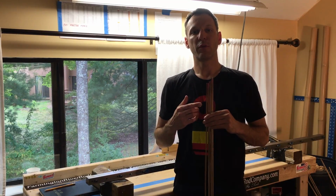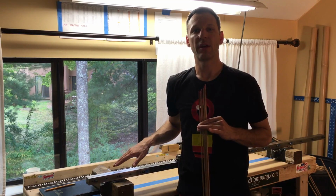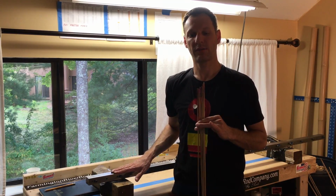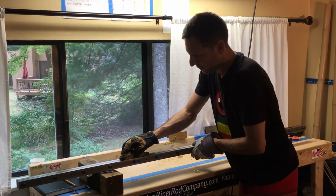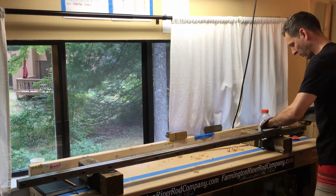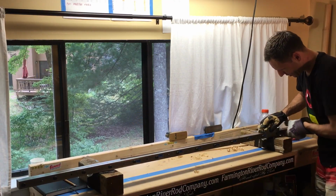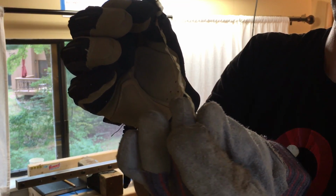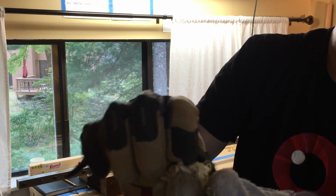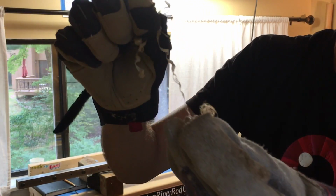I've scraped the enamel from all 6 butt strip sections. I'll now set the planing form to the final specs and plane down to the final taper spec. I don't want to take huge shavings right now because we are at the final spec and there's no turning back, so very fine shavings. These shavings are probably just a few thousandths of an inch thick. And they're all coming off in nice long strands, which is proof of a good sharp plane blade.